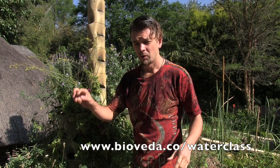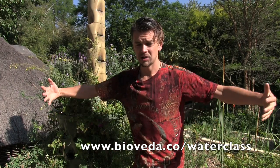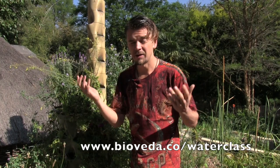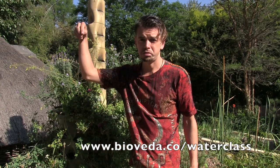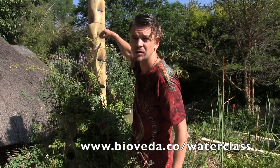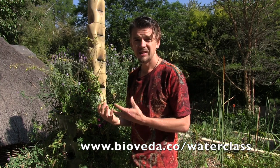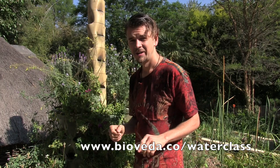You can put a tray at the bottom with a submersible pump that can be a little wetland with wetland plants, slightly bigger, maybe a meter or 1.2, and then gravel, and then you've got the wetland plants that treat that water. So if you're in a flat, you shower or bath, take that water, put it in the tray, and then the submersible pump irrigates it through all of this. Run one pipe here with a little outlet of water that can come down and irrigate your plants here as well. So this can be done in a flat, and there's a bigger version there, but I'll show it to you shortly.